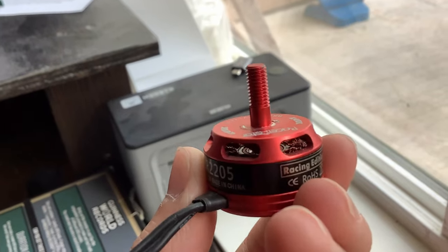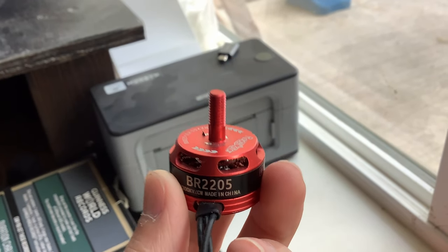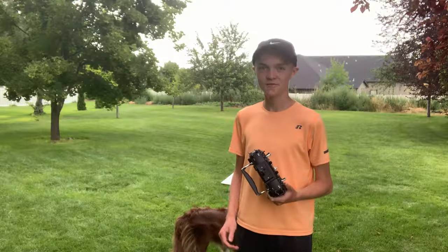Aside from the electronics already mentioned, other issues I had came down to putting screws in too far, which shorted a motor — that was pretty lame. It was also a little difficult to bind the receiver to the transmitter, but luckily there's a nice video about that which I'll link below. By the way, if you're planning on getting the cheaper $20 receiver, just know that even though it has no name brand, it is compatible with Spektrum receivers — so when using it with the TX16S, you have to bind it as if it were a Spektrum receiver.